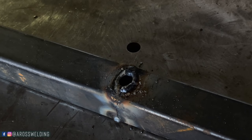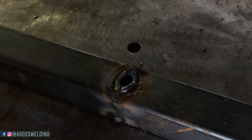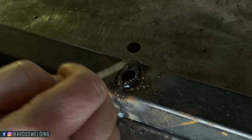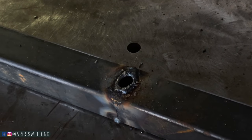We're building up some metal over here and over here. I'm going to let it cool off for a minute, maybe blow on it a little bit, then take a wire brush and knock that slag off — that's going to help you too.